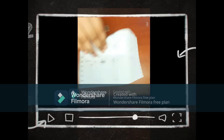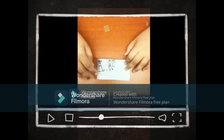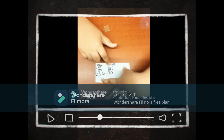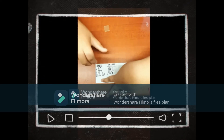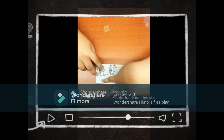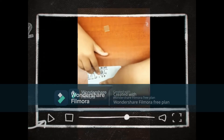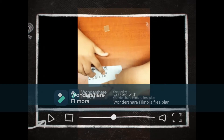The UM66 IC has three pins. From the flat side: the left is ground, the middle is VCC, and the right is output. For the BC547 transistor, from the flat side: the left is collector, the middle is base, and the right is emitter.